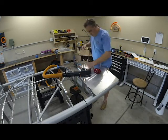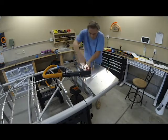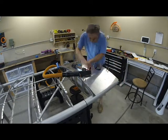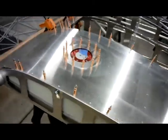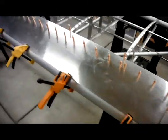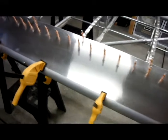Mounting the tank into the wing involved a lengthy back and forth effort — shoe-horning the tank into the bay, taking measurements, drilling or cutting something, then test fitting the tank in the bay again. Once the tank was finally fitting correctly, the upper wing skin was clecoed in place and the rubber scupper was cut, glued and bolted in place. The leading edge sheet, along with the fuel tank cover skin, was maneuvered in place and held with clecos before riveting.